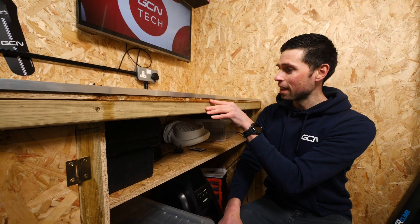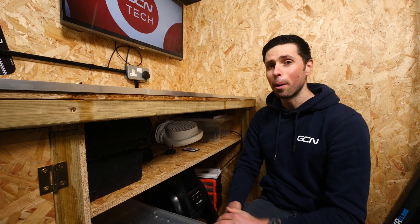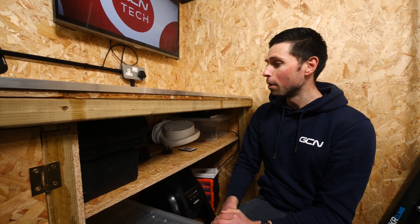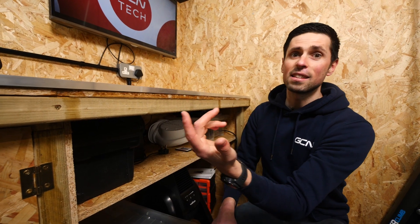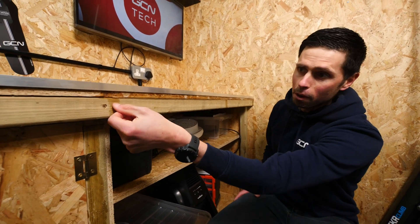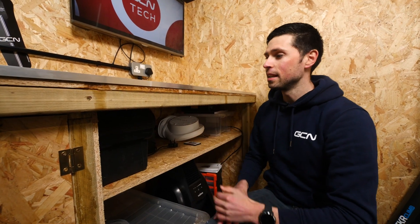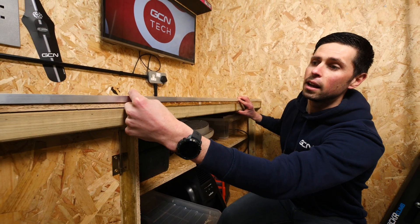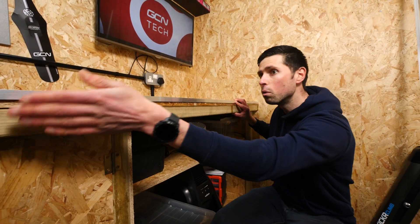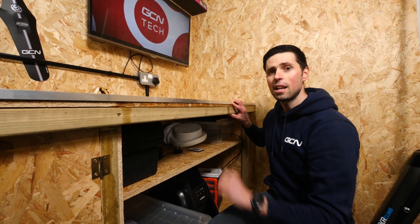I've got the edge cleaned up as best as I can for now, but because it's leaked through a fair bit, I'm going to have to save doing that properly until I've got a weekend with not much else on so I can sand it all the way back to a nice finish. The same goes for some of the other areas where resin has leaked through all the way down — I can clean that up at a later date. Next job today is to get this edging on: cut one section here, then step it down and run a full length all the way along the wooden part of the worktop.